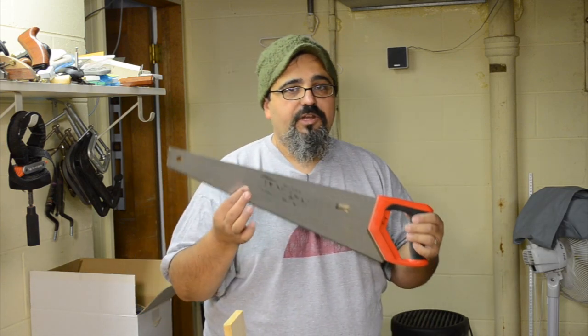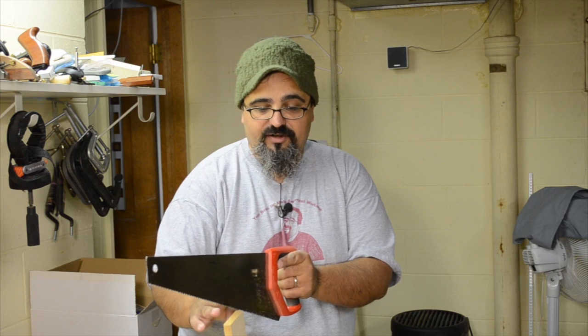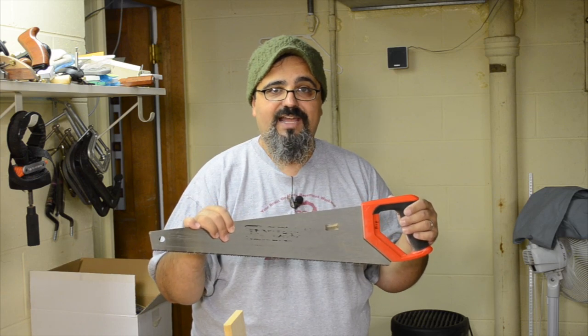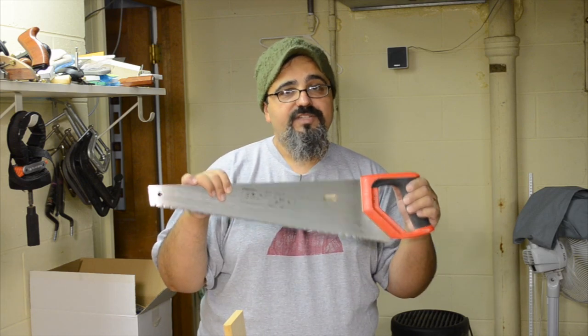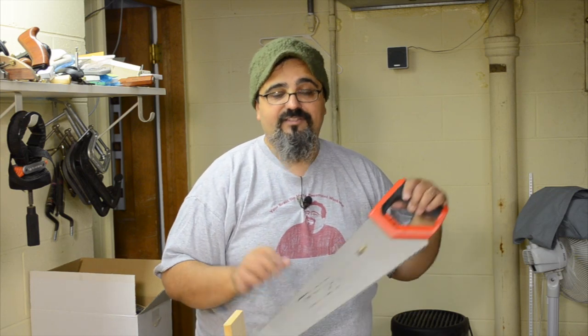Of course, we could skip the table saw and go right to the handsaw. In that situation you'll need a nice rip-style saw since we're going with the grain. Have a lot of patience on this one. I'm not going to actually demonstrate it today because it's been a long time since I've attempted this task. If it interests you, have patience — there's a good chance you will go off-center, so take your time and maybe don't aim for really super thin stock because it takes a lot of practice.